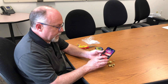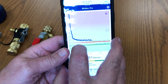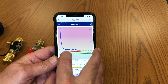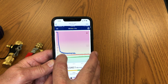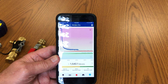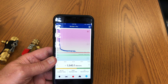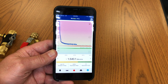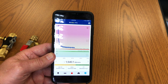When we say we're getting an odd reading, this is what we're talking about. You start doing a quick pull down and you get this sawtooth type pattern. What's happening is the vacuum is actually making and breaking — going deeper, then breaking. The reason you see this is because the BlueVac gauges are just such high precision, high accuracy, and high sensitivity gauges. You're seeing things in vacuum you might have never seen before because other gauges simply don't have that type of sensitivity.